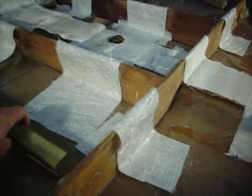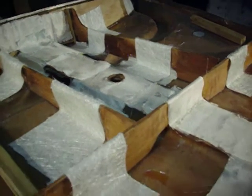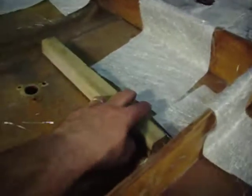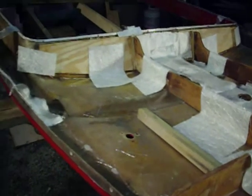In between here, this boat — the gas tanks were originally in the back. My neighbor added the gas tank up under the bow of the boat. I'm assuming when you walk on it, there's not too much support. So I'm just reinforcing everything that's here. I'll add some two-by-twos in the middle here and glass over those, and here as well. Nothing major, but he never had a problem walking on it. While I have it here, it can't hurt to add some extra support.